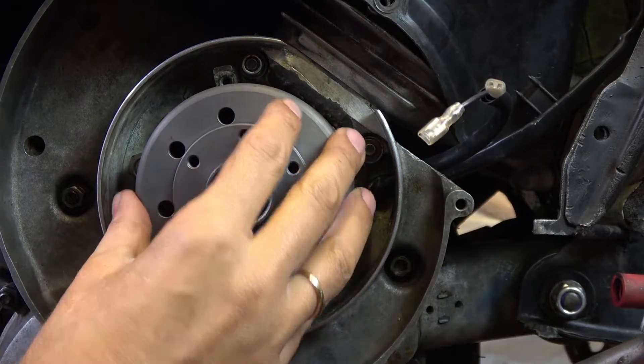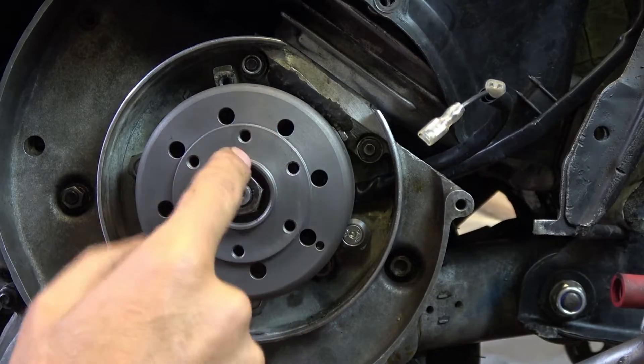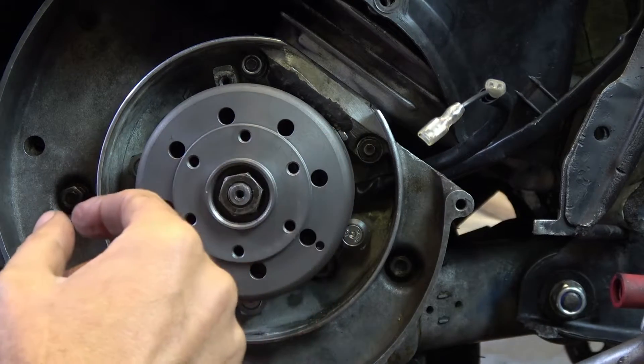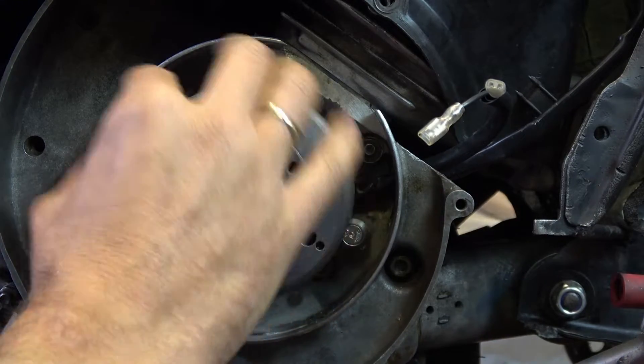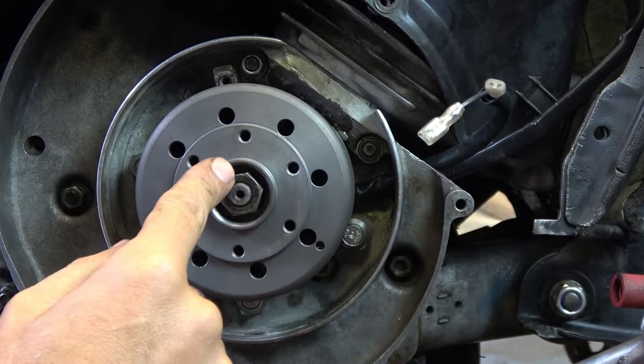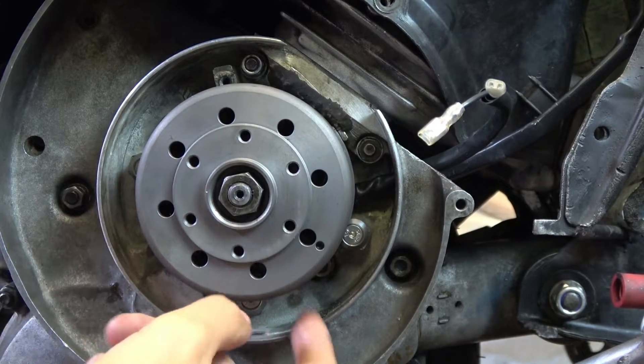You don't actually have to use the fan for doing the strobing — it is okay to use just the flywheel if you want, as long as you don't read the wrong spot, because obviously a cooling fan is not going to cool very well if you do.